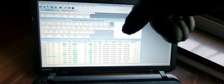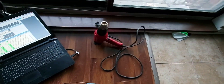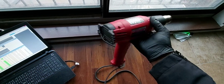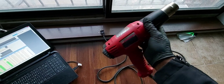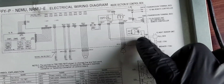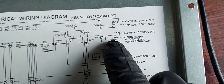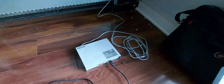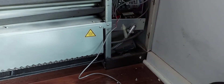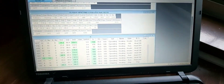I'm going to leave a link to both videos in the description — they'll show you how to get connected and set up the system. Currently I am not on the roof; you can see I'm downstairs. This heat gun is here because I had to add refrigerant — the system was low and I needed to warm the refrigerant tank. Right now I'm connected on M1 and M2 on the indoor unit — that's where the tool is connected, unlike the previous video where it was connected on the roof. There's the control board, and I'm connected over there.